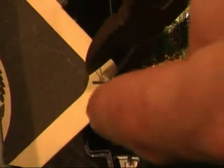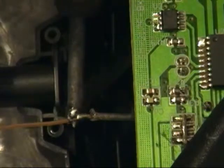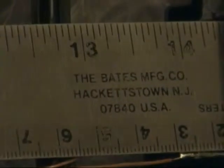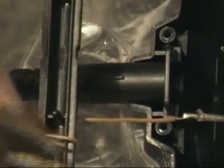So I cut off the existing antenna, stripped it a little bit so I could solder onto it, cut those little ears off as best as I could, and soldered on a piece of wire. Then I measured it out and cut it so that it was double its original length. So if it was 2.7 centimeters, that gets me up to 5.4 centimeters — so that's where I cut it.